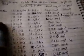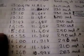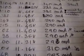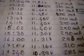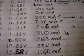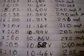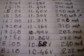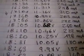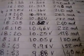So from 1 o'clock to 3 o'clock it was always 290 milliampere, and around 3 o'clock I thought something was increasing the milliampere, and in effect exactly at 4 o'clock it was 295. 1 hour after, at 5 o'clock, it was 310 milliampere, and it stayed like this until 5:48. Around 5:48, a little bit before, when it was around 11 volt, the milliampere started to decrease and went down very quickly, like in an hour, as you can see, until 6:20. At 6:20 it went down to 10.25